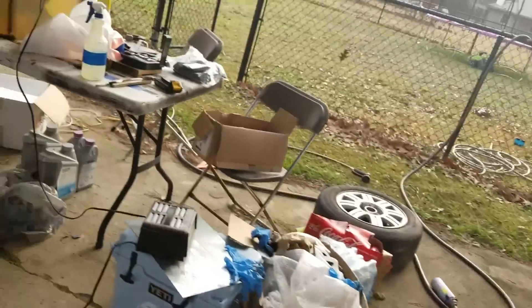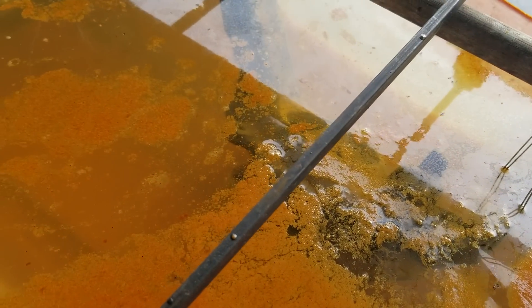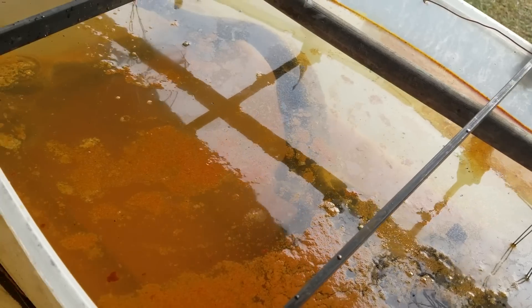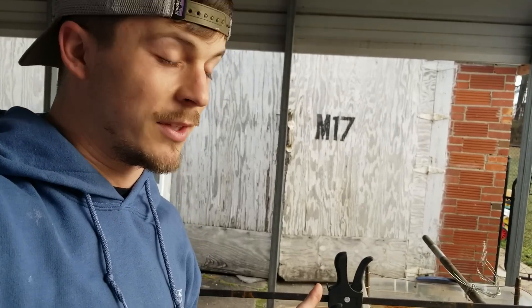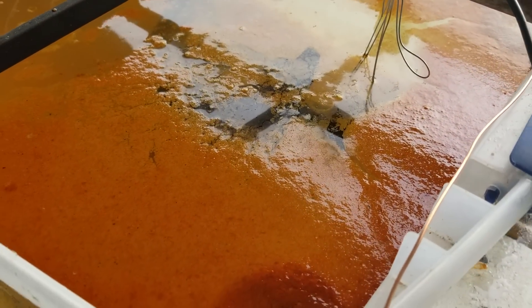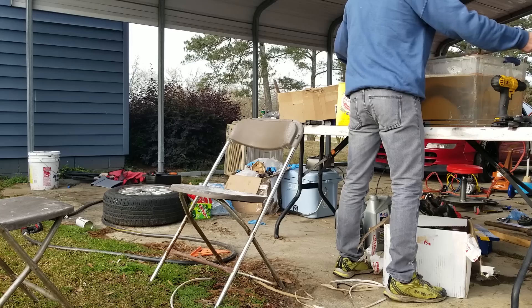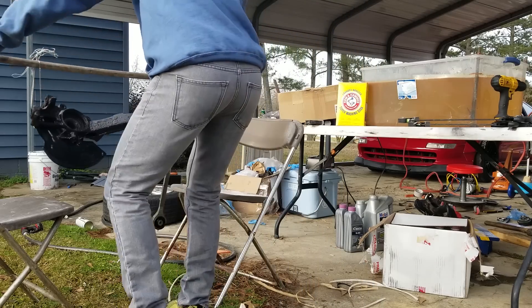Alright, so it's morning. The part has been soaking for about 18 hours. I checked it last night and it was still kind of fizzing a little bit, but now it's not fizzing at all and a lot of the rust has settled to the bottom of the bucket. I guess that means at some point it just stops — whenever the rust gets all the way off. If anybody knows more about this in the comments, let me know. There are no more bubbles coming up, which makes me think the rust is completely gone. Check the bottom of this bucket out — just a layer of rust all the way across. I'm going to pull this thing out and rinse it off with some water, then figure out what to do with this nasty water.